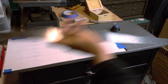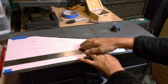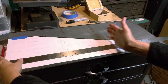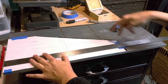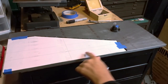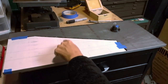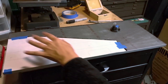I found I needed to be careful because the first time I did it, the overall length was not right, so I printed a second one and made sure the overall length is right. This edge is not critical, this edge is not critical, this edge is not critical. But what's critical is the width from here to the top of the hole - the hole spacing is very critical and it's very critical that this be square. You also have to be careful about your dimension lines - I have some ISO lines on this which maybe I shouldn't include in my print. You have to make sure that you don't cut on reference lines or dimensions.